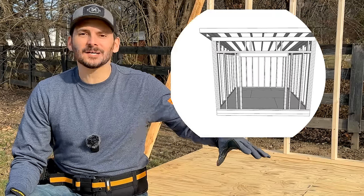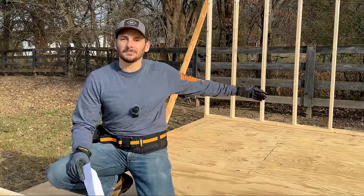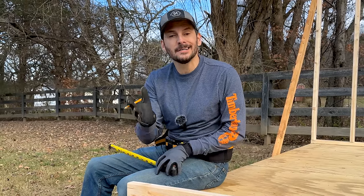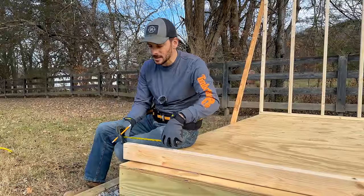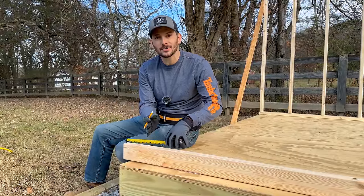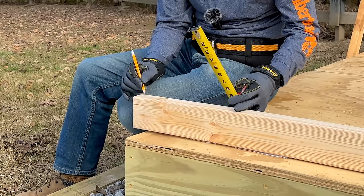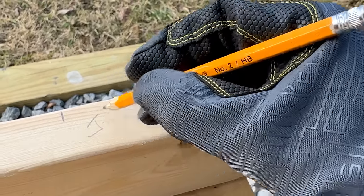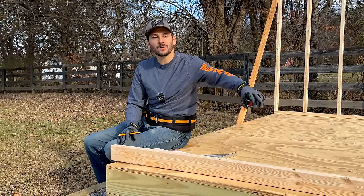The front wall is definitely going to be complicated — we've got double doors plus three windows up top. Instead of having a standard top plate and bottom plate, the very top is going to have a 2x6 header, so I'm building it from the base up. Since the front wall has openings, we'll have different stud lengths. I marked an X where studs go, and for the outside corner I'm designating a K for king stud — which goes all the way to the top — and J for jack stud, with two different lengths: J1 and J2. That defines my corner studs, and then I can lay out the rest of the studs and the door opening.